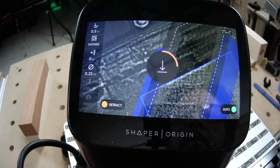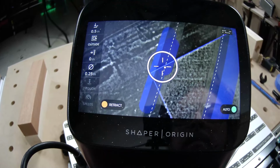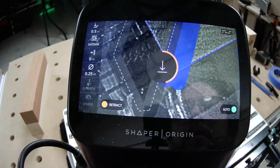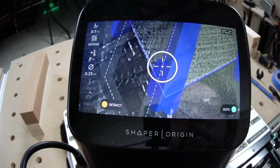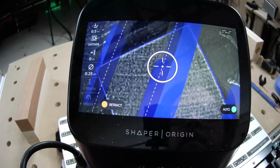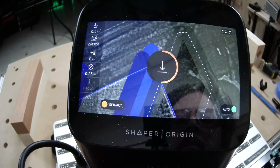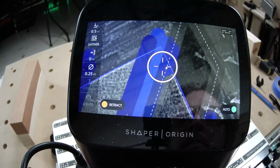We like doing some simpler shows, but we are going to go back with the file for this one and walk through everything start to finish. But for now, where we're at, Jake is doing the outside cuts on this template, cleaning those just right up to the line with the 1/4-inch bit. And then he's going to come back in with the dovetail bit to cut beyond the line, kind of undercut that, and give us the second part that should fit with the first one that we cut before the show. This was already gridded. We're going to talk about gridding for this in the second half of the show. We're going to talk about stock size, design in studio, all that.